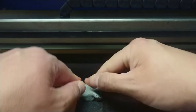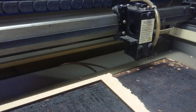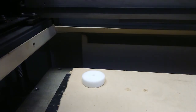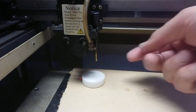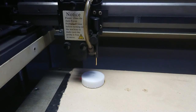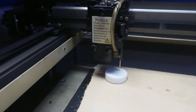Lesson learned - normally I use hold-down screws and the autofocus pin clears them nicely, but I was lazy and put blue tack in, and a big blob got picked up on the tip. Not the end of the world. I need to lower the bed slightly so the camera goes down with it. Where our wax is, we need to bring the cutting head over and focus on that. I'll check the pin is working - there's a bit of sticky junk still left on it. Let's autofocus, then turn some air on and start this job.